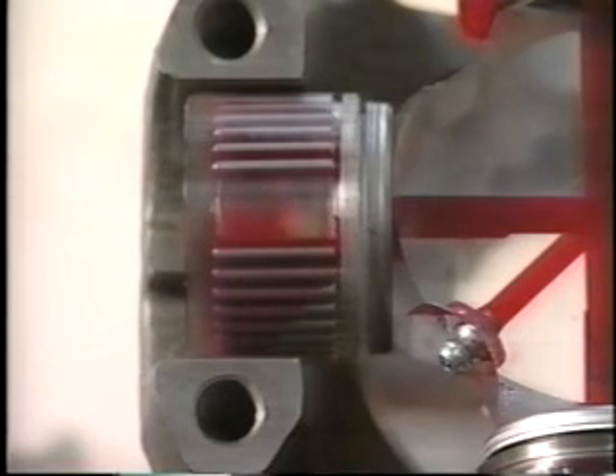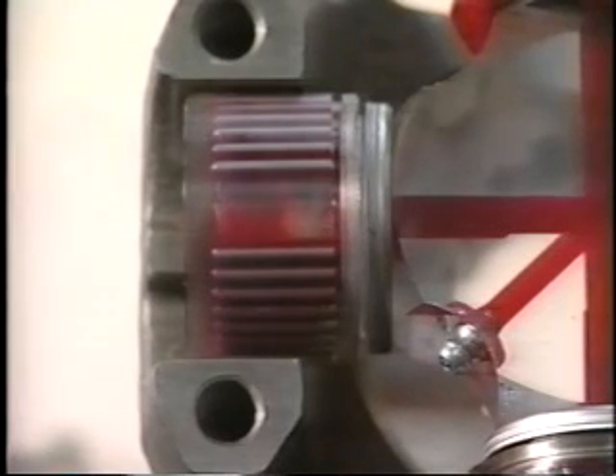Also note the small amount of air entrapped at the base of the PPV valve. This occurs because the lube passes through the PPV valve, reaches the bearing cup, and then is forced back around the outside of the PPV valve, entrapping air.